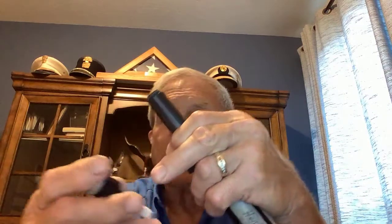So it's pretty straightforward. This one's like a 90-degree to 120-degree spread on the spray. If you want to change that to say 180 degrees or 360, you can change out these heads just by merely unscrewing it and going to the store and buying a new one of these that then screws back in here, and you've got it covered. Notice there's a filter in here to prevent grit and whatnot getting into the spray head itself. So you may want to periodically take these off, clean them up, put them back in.